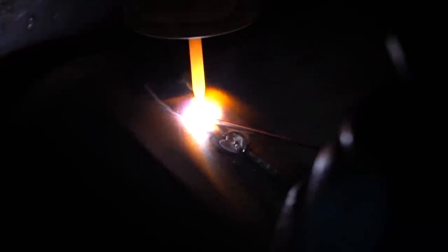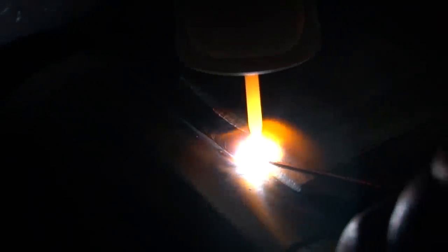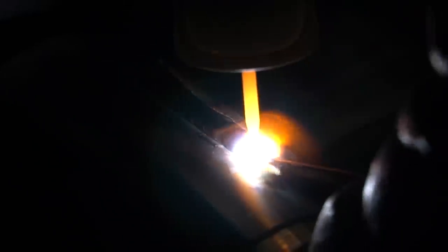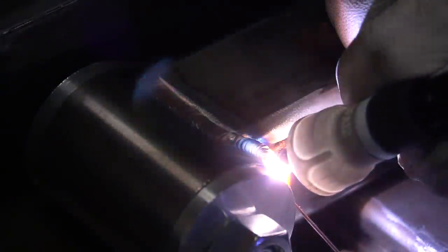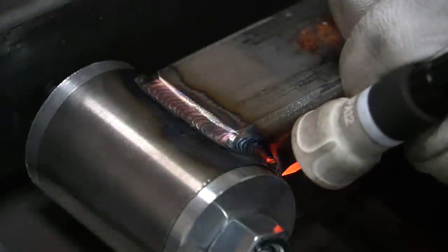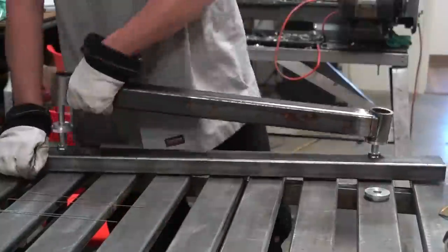You'd think you have to throw in a ton of filler wire, but it's actually the opposite. I want to add more filler wire to my weld pool to establish the bead and maintain control, so we use smaller filler wire. We can always add more from a smaller filler rod but we can't always add less from a larger one. So with 0.045 filler wire, we're just really pushing it in there, making sure it all wets in and blends and bleeds to both sides of the land and onto the bushing housing itself. I'm full throttle the entire way through.